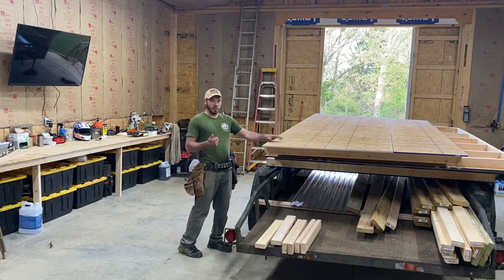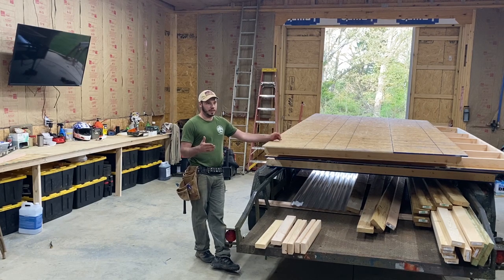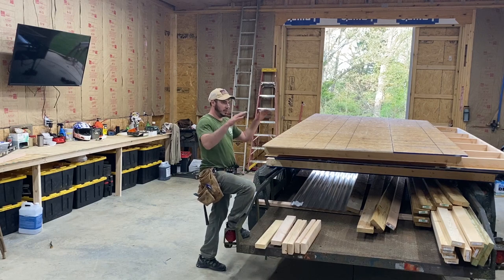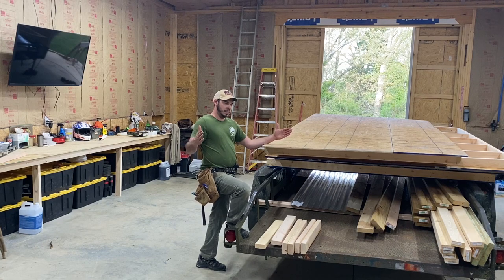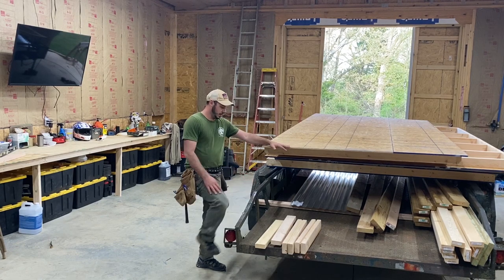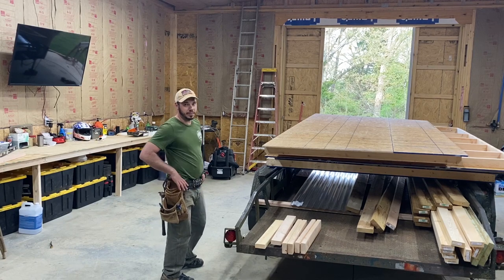Today we got the walls built, we got all the rafters cut, got all the floor joists cut, and last minute I changed the way I'm going to do the flooring a little bit. Instead of just spanning the whole 12 feet, I'm going to put a couple beams on posts instead of just connecting the floor framing straight to the post. We're going to set on top of a couple 2x6, and that'll allow us to reduce the amount of clear span between all the support. It'll work out a lot better, I think. So, thanks for watching. We'll pick back up on this in the morning.